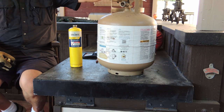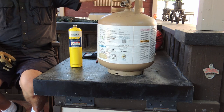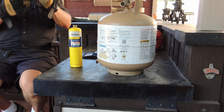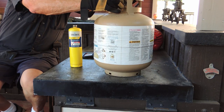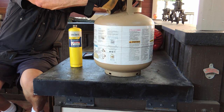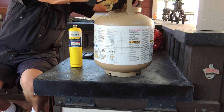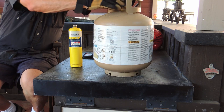Next, make sure the valve is closed on your 20-pound tank — if the valve is closed, there's no propane going to flow. But once you attach the adapter, it will allow propane to flow. So if you attach it when the valve is in the open position, you might get sprayed by propane. Always make sure it is closed. The next step is to attach the adapter. The adapter has the acme nut and uses external threads — right-handed threads, so you turn it in the clockwise direction. Just get it hand tight.